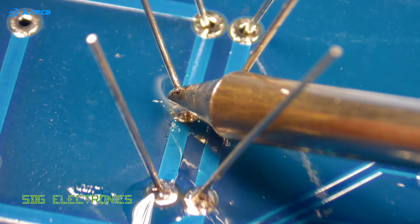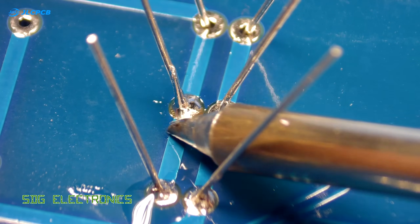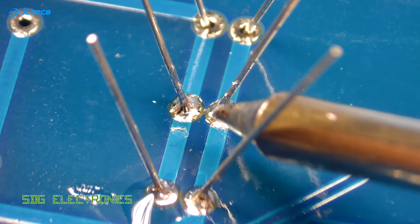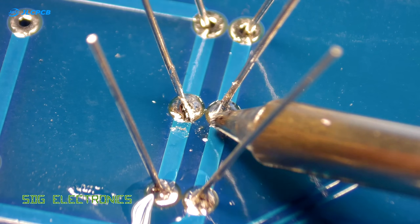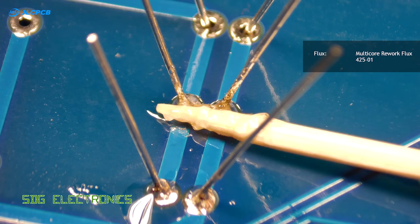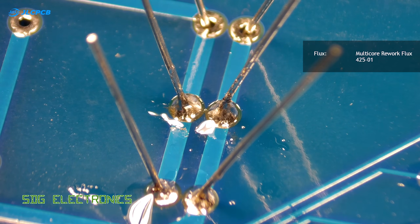The same situation occurs when playing with the solder joint with your soldering iron burns off all the flux, and the solder no longer forms a shiny joint. To rectify this, either apply a bit more solder to the joint or apply some flux and reflow the entire joint.